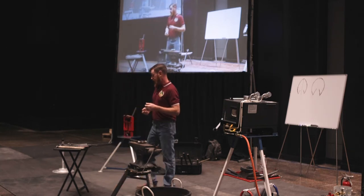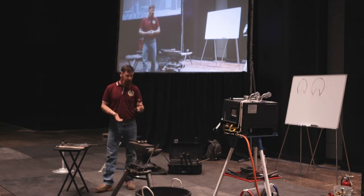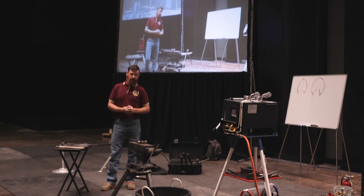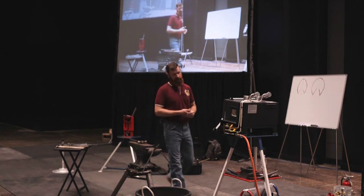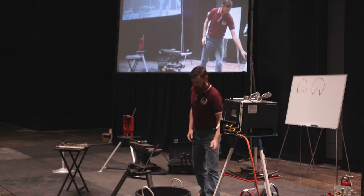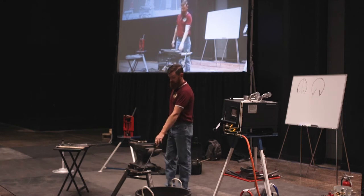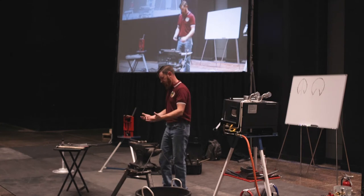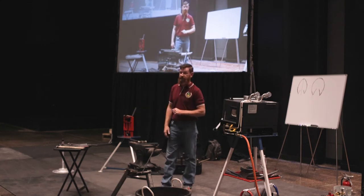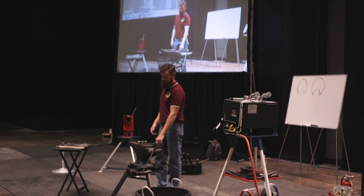So having that point of view reference is huge. At the angle that goes there as well, a lot of times when your perspective of something being square at the angle isn't necessarily square to the world. You gotta think about where we are on the anvil and our eyesight is more over this way, right? So we're gonna wanna do that to the section, right? And then when we pick it up, all of a sudden we've created a bevel, you know? So you gotta keep in mind that your point of view isn't necessarily always accurate in that aspect too.